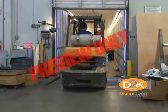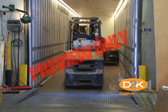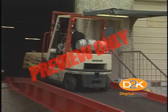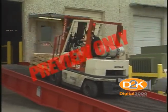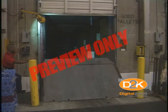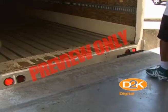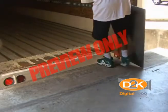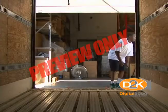Portable and powered dock boards shall be strong enough to carry the load imposed on them. Portable dock boards shall be secured in position, either by being anchored or equipped with devices which will prevent their slipping. Powered dock boards shall be designed and constructed in accordance with commercial standards. Handholds or other effective means shall be provided on portable dock boards to permit safe handling.